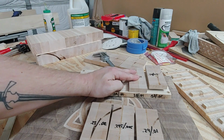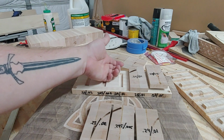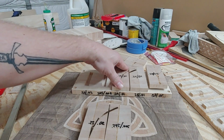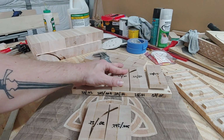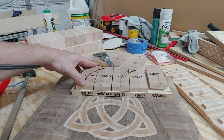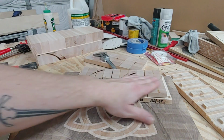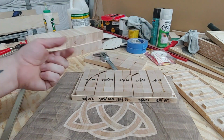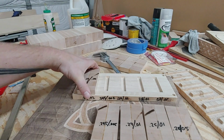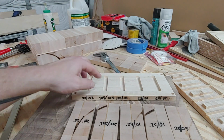And I feel like what's happening when I'm pushing it in is the top of this is hitting the floor, basically, of this other one. And because I did it at 26, so I could get the 25 start, that's why I have this little gap. And then this is the one I think is going to be my winner. But I'm not really going to know until I peel it all off. But it feels like it's got the best combination. These go in, but I feel like the more I go in, the more I start building that gap again. So we'll see when we get all this cleared off and can actually run it through the table saw and look at the profile and see what kind of gaps I got. And we'll see the tops of it where I can see what kind of seams I got, because I want the optimum gap at the bottom where there's no air pocket and the tightness around the edges for that perfect seam.